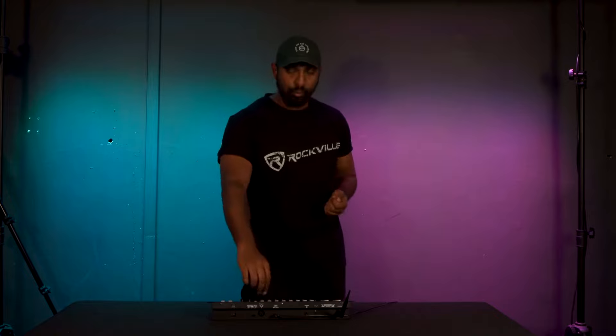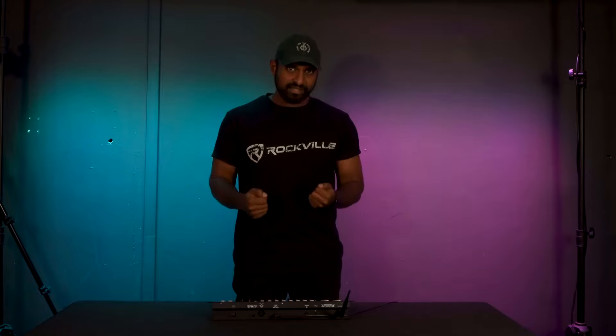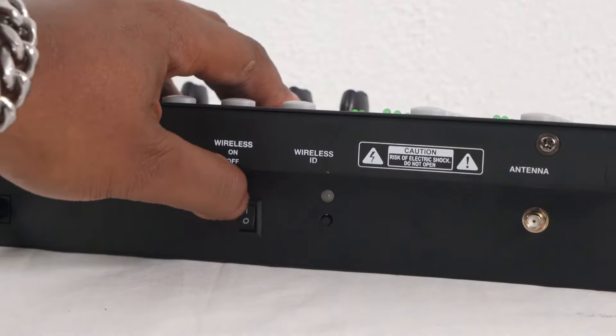On some lights the polarity might be different, so once you plug in a cable from this controller into the light you might have to adjust the polarity with the switch. Right next to that we have a DMX output, which is used with a wired DMX cable to go from this controller into your light. Over here we have our wireless DMX power switch, which allows you to turn on the 2.4 gigahertz wireless DMX technology.